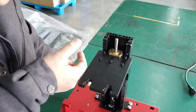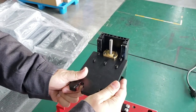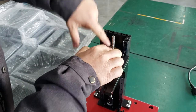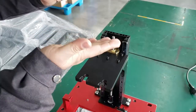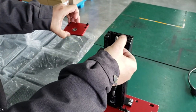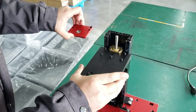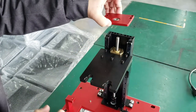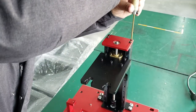By this way, you can get a very good backlash. You can see here we move up and down — it's almost no movement. The more pressure you give to the top nut, the better the backlash will be, because stronger spring tension on this nut makes it tighter. This improves printing quality and precision. Thank you for watching — let me reinstall the top cover.